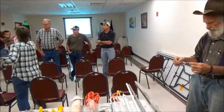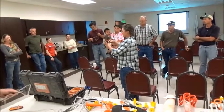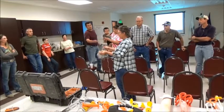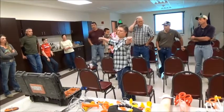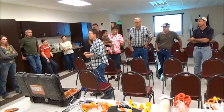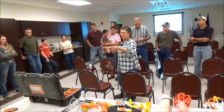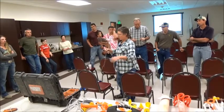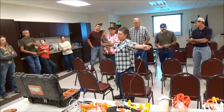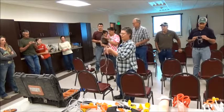Yeah. What's going to happen is you're going to go along and put your fence back up and you're going to think, oh, my fence is fine. But in the middle of really good fence is going to be a chewed piece and you won't know it unless you go along and you feel the whole damn fence. So when your fence goes down and the calves chew it, I'm sorry. You're going to have to go along and cut all those out and use your nice rabbit ear, bunny ear, rabbit eye to connect the good ends.